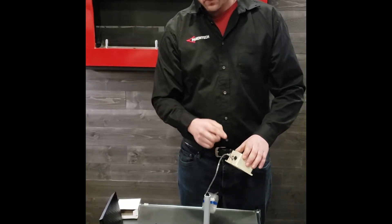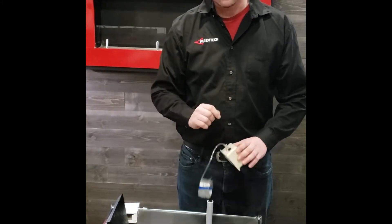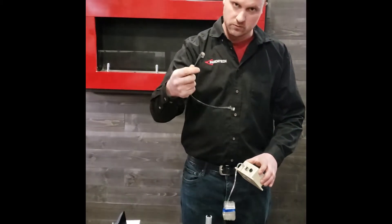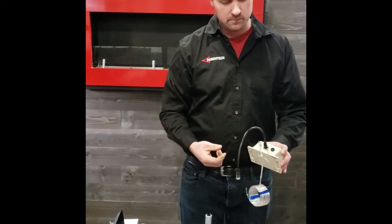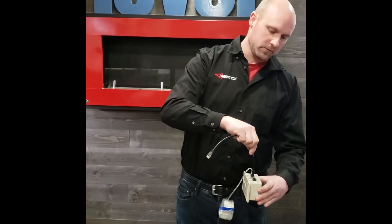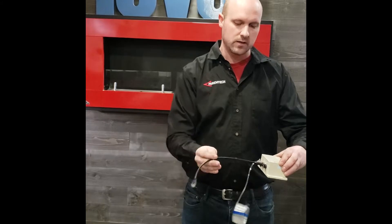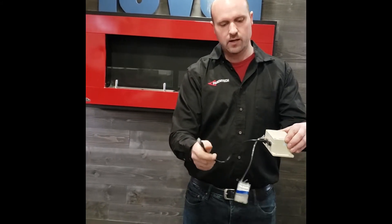With the Ethernet connection, you run your cable from your home router outside to your system where this device is installed, and connect that cable in here. I have a cable here just as an example — this would be your long cable, either buried or however you run it. You connect it directly to the PT Level device. When you install this, make sure it's not sitting up so water gets in the connection — have it like this or flat. Another good assurance is to have a drip loop somewhere so that water won't run in on the cable into the connection.